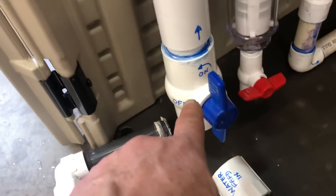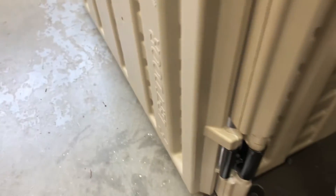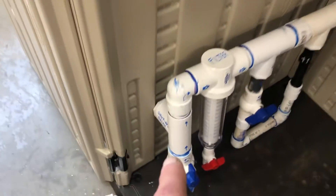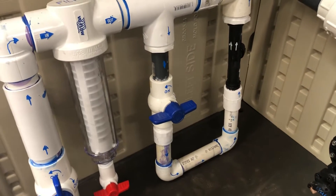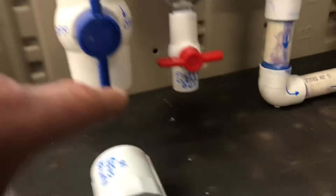This is an air vent that gets turned on when I shut the water off over here and then turn the outside shutoff valve — when I open that up, air will push through and be able to blow out a little bit more just with gravity. I also showed which direction the water is going, and that this is a filter. Over there I can put that that's the inlet venturi fertilizer injector. I put on it that if you turn the knob this way, it's on; you turn it that way, it's off. Same over here — and this is the cleanout.